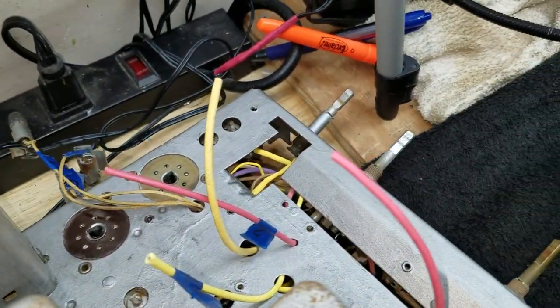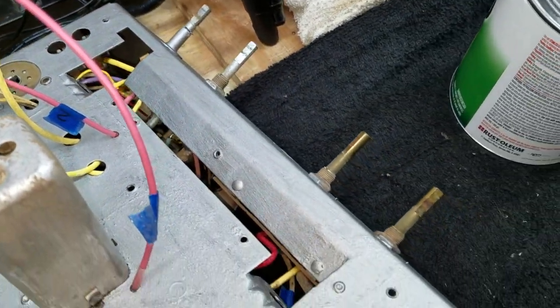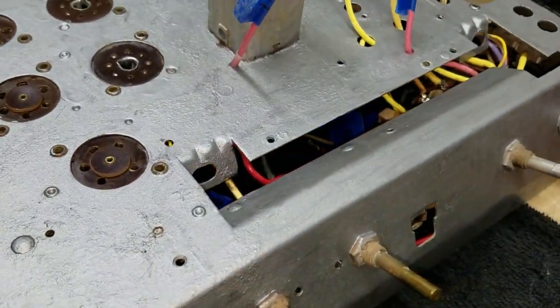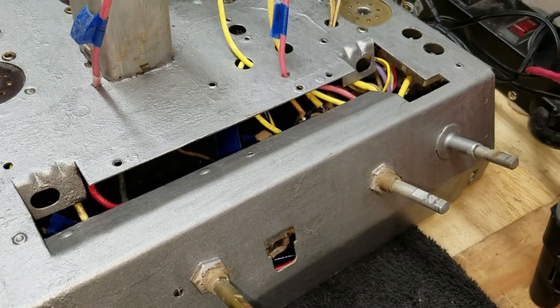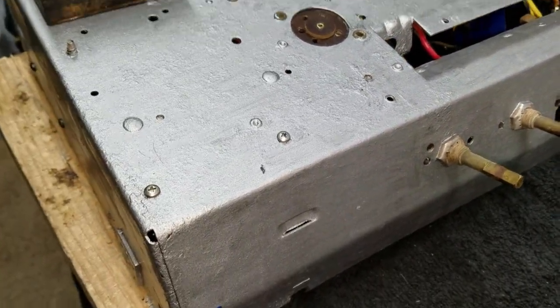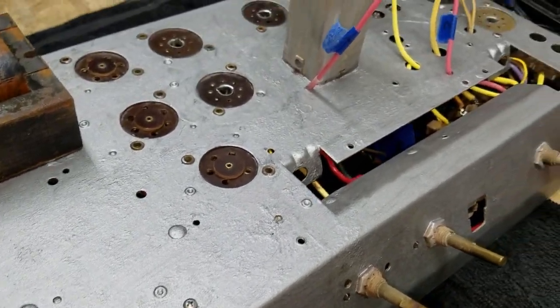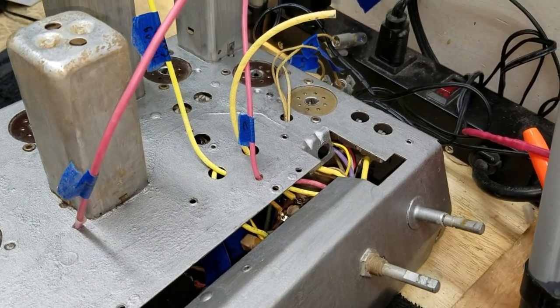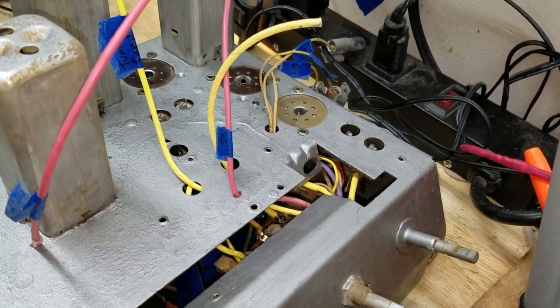If I wanted perfectly smooth and if it was imperative that there be absolutely no brush marks, then I would have sprayed, but that takes a lot more time to prep and a lot of time to clean my spray equipment and stuff like that. So I kind of like this. I think this method's going to work fine. We'll do a second pass. If I really hate it, then I can always spray after, but I think this is going to look real good.